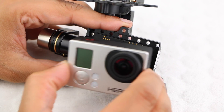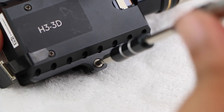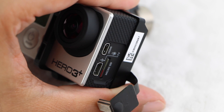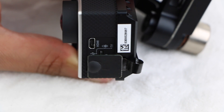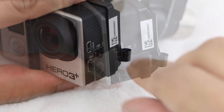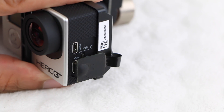Place the GoPro camera into its cradle, which is held in place with the retaining bracket and secured using two M2.5 screws. Remove the GoPro side door and ensure a micro SD card is inserted before plugging in the USB adapter. This charges the GoPro and provides a video out feed for an FPV setup, which we'll be taking a look at in a future video. Note that users will need to remove and reinsert the delicate ribbon cable every time access to the memory card is required — not the most user-friendly solution, and a downside to an otherwise high-quality setup.